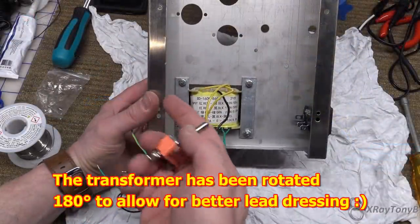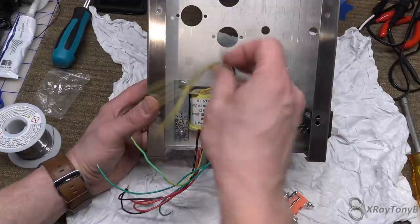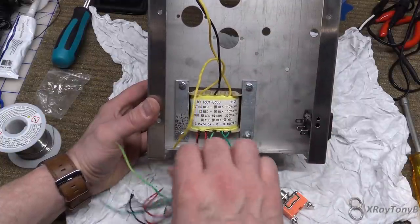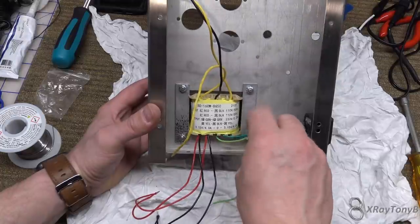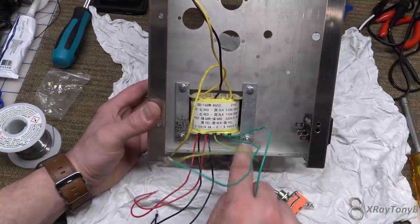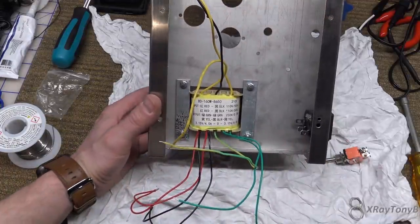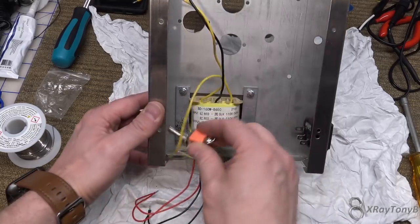Getting to the point where we're ready to put the power switch in, I noticed it would be much better lined up if the filament leads go straight up to the tubes and the power lead is right next to the switch. The high voltage ones — we're going to put some little keepers on here to keep them away from this edge. This is a much better layout. It only cost me a couple minutes to switch the four screws around. Now we're going to mount this power switch.